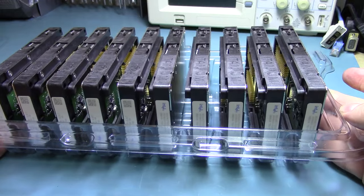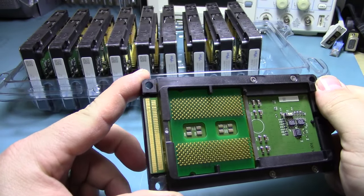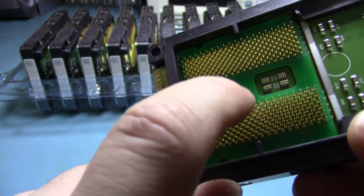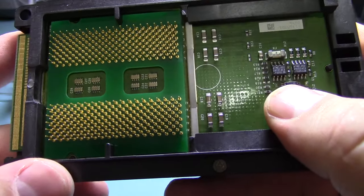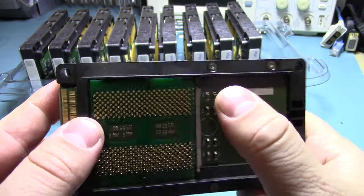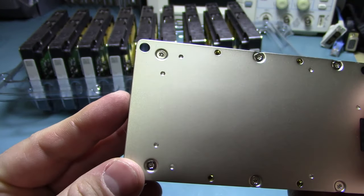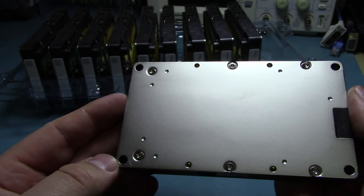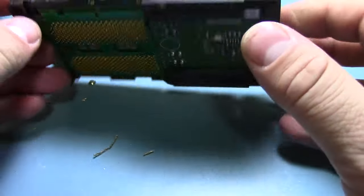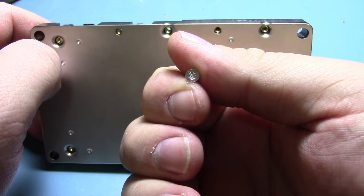This is a moderately dense packing container and these are heavy. The socket has a strange design — connectors are on a second PCB and there's an Atmel chip, what look like EEPROMs, a small fuse, and some security bits holding on the top plate. These are not actually Torx bits or Pentalobe bits — they're rounded on the ends.